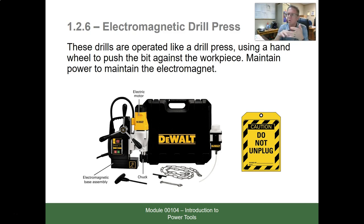That distinction is important for motor control, transformers, and other topics we'll cover later. With this electromagnetic drill, do not unplug it during use. You place the drill on a metal surface, chain and bolt it down, and when powered on the electromagnet holds it firmly to the base. If you lose power, the electromagnet releases — which is why the safety chain is required. If power is lost while drilling, there is no residual magnetism to keep it secured.